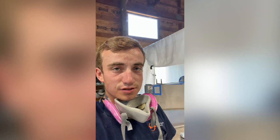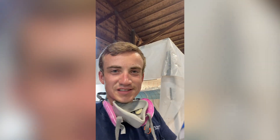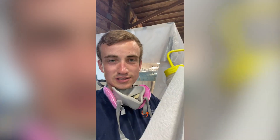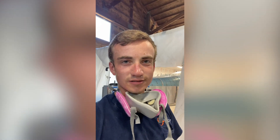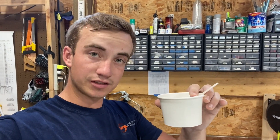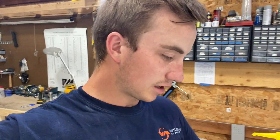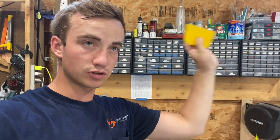Got the shine off of it, blew it off, now I've got to take some isopropyl alcohol — probably not pronouncing that right, that's okay — wipe it all down with a paper towel. Got it all sanded and masked off, cleaned off. Now mixing up some West Systems epoxy resin, then going to use a squeegee to get it to sit down into the pinholes.